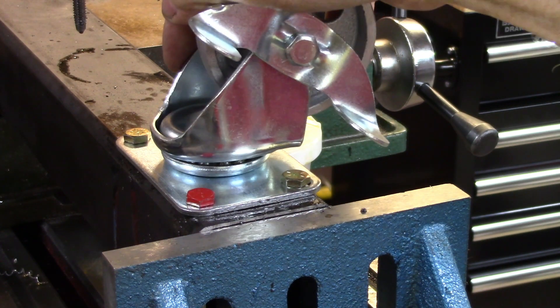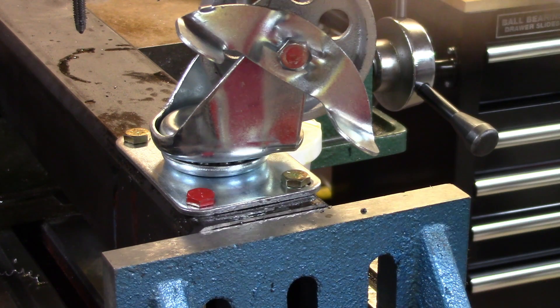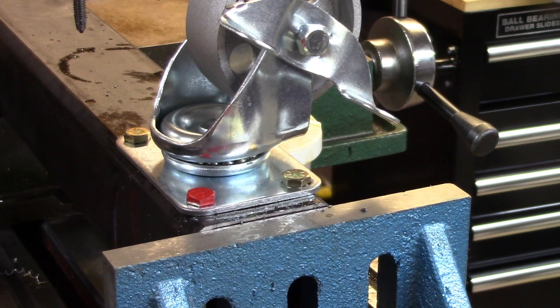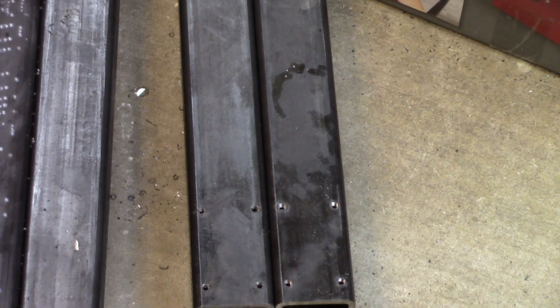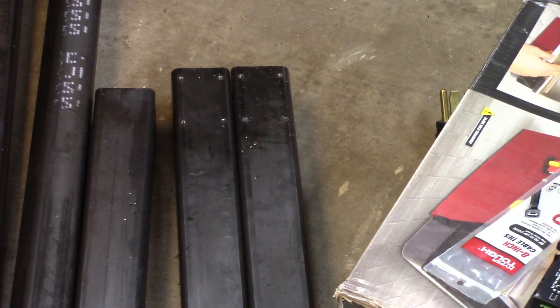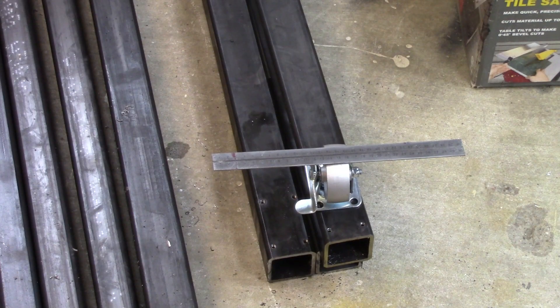The wheels are on there. I'm going to have to do this three more times - the drilling and the threading. I'm not going to leave the wheel on there because this thing will get painted and there's no use painting the wheel. Once I've got everything stacked up to the assembled height, it looks like more like nine inches, so I'll have to take those long pieces and cut nine inches off the end of them. Even though I had it pre-cut before I got here, I still have to cut it one more time - I guess that's why you buy saws.